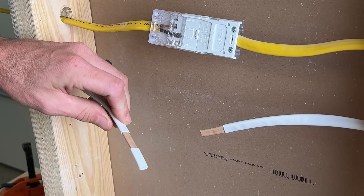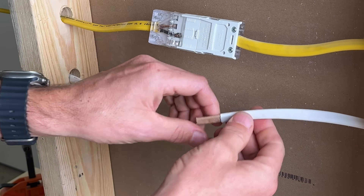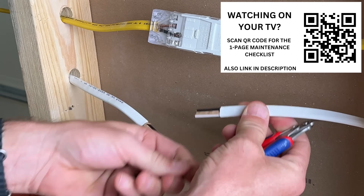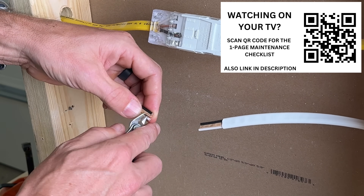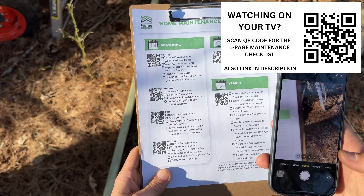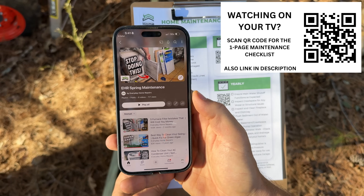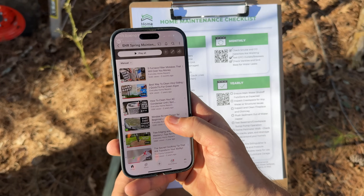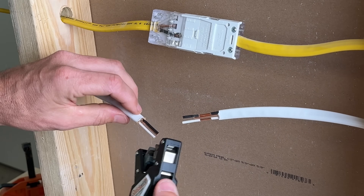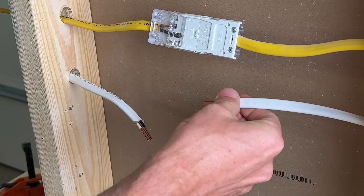Here in the US we have a paper cover that needs to be removed; in the UK they do not. While I remove that, I'll mention we have the updated home maintenance checklist — over 5,000 homeowners have downloaded it. There's a link in the description and a QR code on screen. It's a quick reference for what you should be doing monthly, seasonally, and yearly, with QR codes for a full step-by-step process for each line item. Now with the paper removed, we'll take the same wire strippers, line the edge of the jaws up with the jacket, and that will take off the exact amount of insulation from the hot and neutral. Pull off the insulation and we're ready to go.